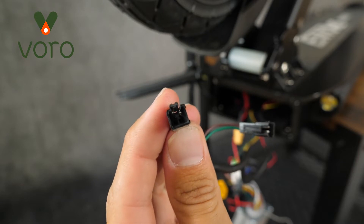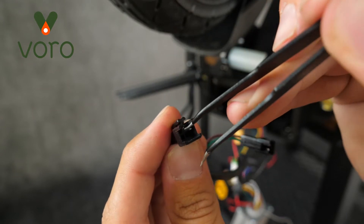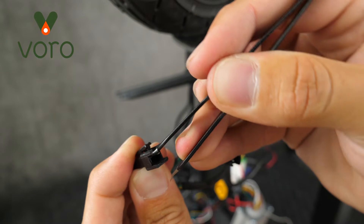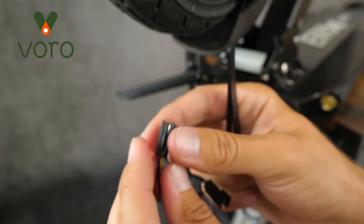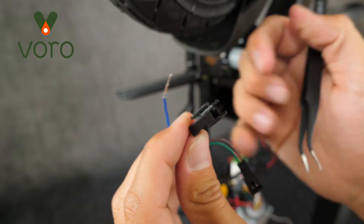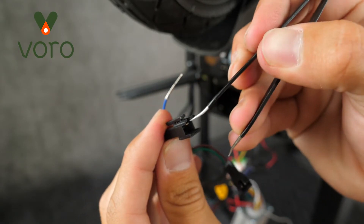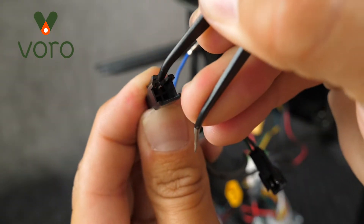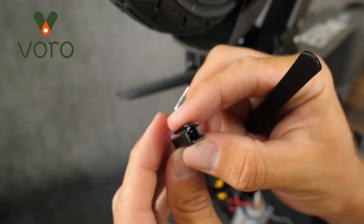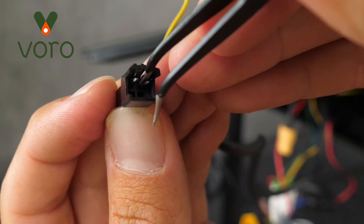Now we are going to separate the wires from the connectors. Hold the connector in one hand with the lock facing the ceiling, and in the other hand with a pair of tweezers, stick them inside the connector just above the prongs. There should be just enough wiggle room to fit those in there. Then wiggle them up and down a little bit — it's important to be careful here. Once you've done it right, you'll be able to remove the wire from the end of the connector. Essentially you're unlocking the wire; the locking mechanism is on top of the wire. Using the tweezers, you're able to unlock it and pull the wire through. Do the same on the other ones — insert the tweezers, wiggle them around a little bit, and then pull the wire right out the back. Remember to fit your tweezers just above the prong; there should be enough space in there for you.